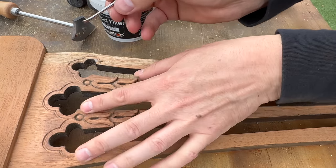Here's my plan to fix the problem of different colors of wood: I'm going to use lacquer toner, starting with mahogany color just to give those bottom pieces a little bit of red. Then I'm going to use walnut color on top of the mahogany — this gave me the best result. This is not an exact science; you basically try and see what works. I was going back and forth between those two colors until I was happy with the blend and felt like all the pieces looked the same.